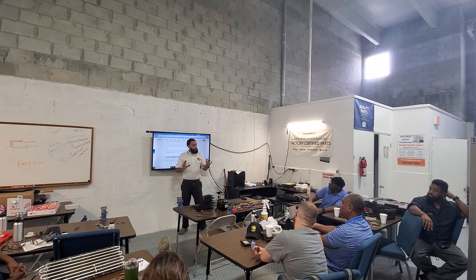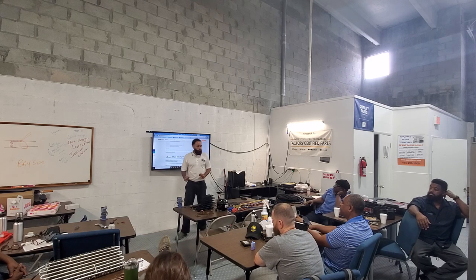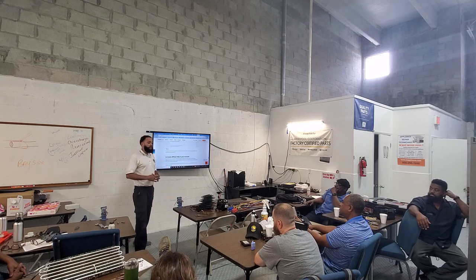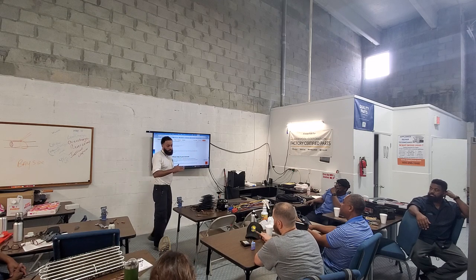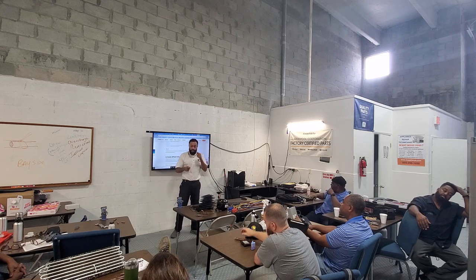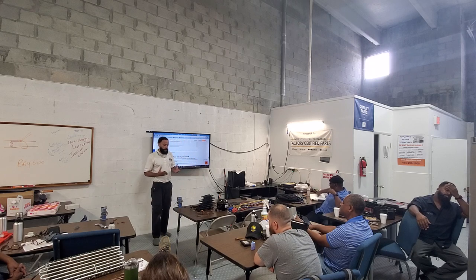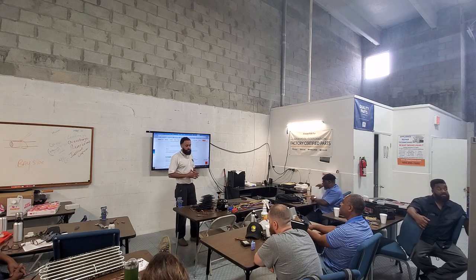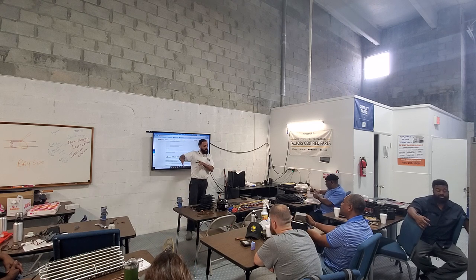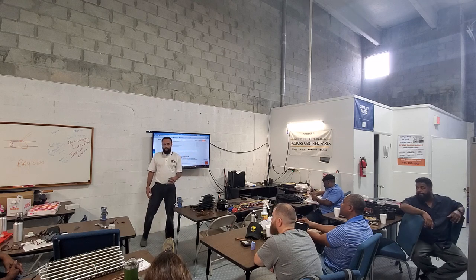Okay, again, in the most simplest terms, it just boosts it up. So that compressor may not necessarily run at 240. It can run anywhere in between, 120 to 240. You may test output voltage and get 175, okay? But that's what an inverter does. And I'll give you more training on that in today's later class on schematics. We'll talk about that, you and I.